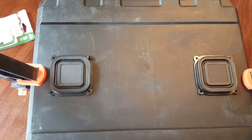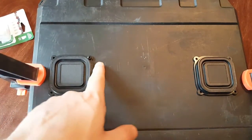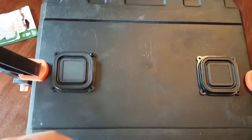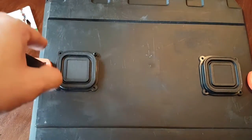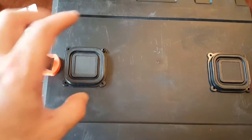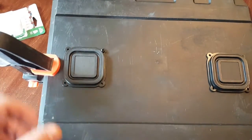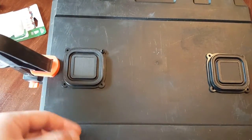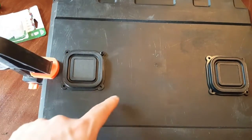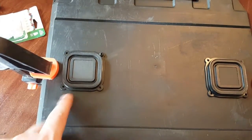I went ahead and got the first screw in. When putting in that first screw, I drill the hole and then I put the screw in — reason being to make sure it doesn't move while I put the next screw hole in. A lot of people drill all the screw holes first and then realize one was a little off. You'll negate that by drilling one and putting the screw in right away.